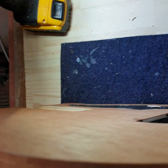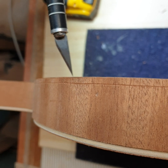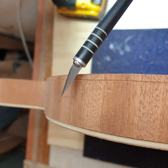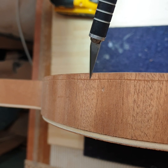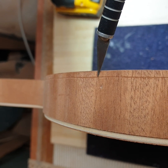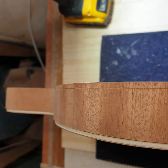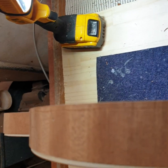And then what I do is I go over it with the scalpel, this woodworking scalpel I got from there. And once I've made the initial scribe along the veneer, it leaves an indentation, of course, so it gives the blade somewhere to run along in that cut, or that bit of a trough or a channel. So you can run that along there and scribe and cut even deeper, but you need to be cautious.